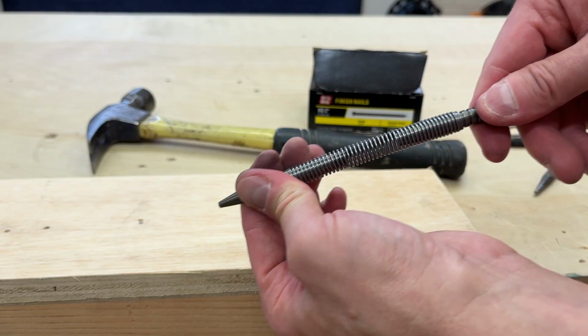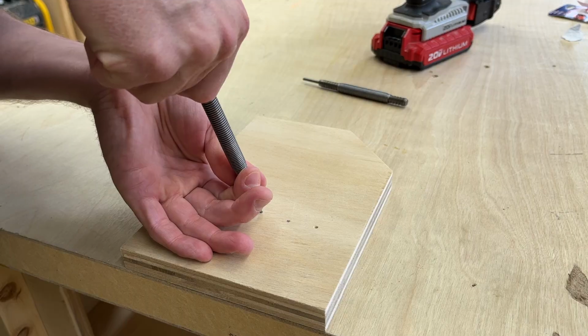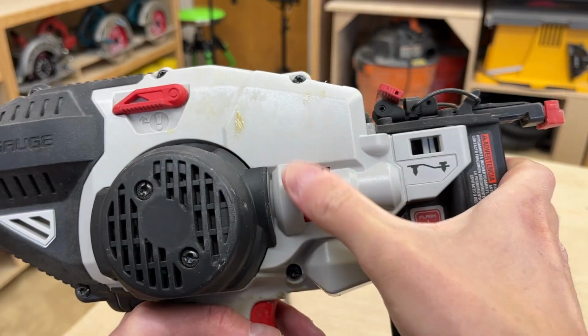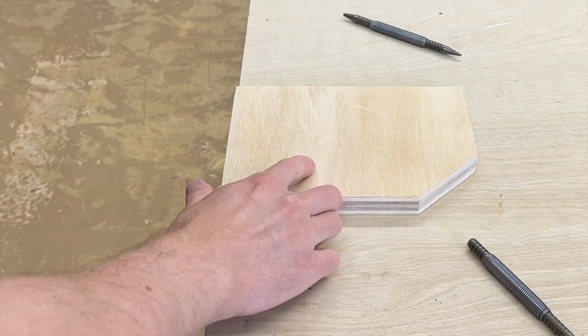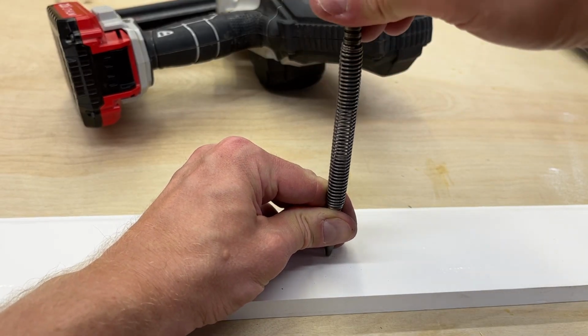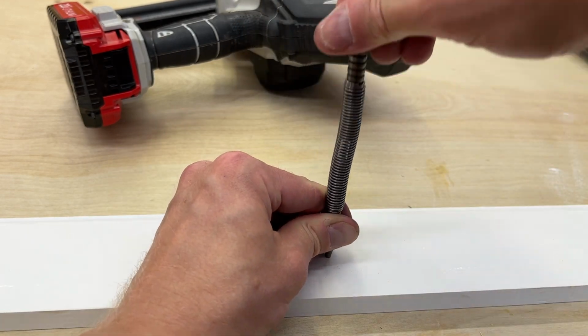The action launches a driver pin encased in the spring. This pin taps the back of the other point with a sharp, fast knock, and the point transfers that energy straight into the fastener head. It countersinks so cleanly, it still amazes me every time I use it. Sometimes brad pressure isn't exact, and you wind up with little proud fasteners everywhere. Lining up on them with a nail set and hammer can be tedious. But the two-handed approach of the spring set lets you hit these things quickly and accurately. And if you don't sink it in one knock, just do it again.